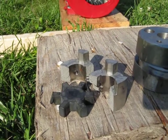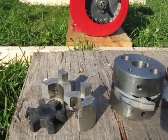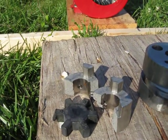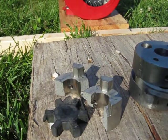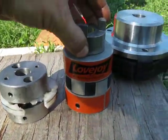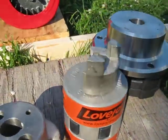It was a Lovejoy coupling, but I didn't advertise that at the time — I took the stickers off, just because you're not supposed to show name brands on YouTube. In the initial run, I only had about 5 seconds, maybe 20 seconds total before I broke the coupling on number one cylinder, as you can see here. Now, in all fairness to Lovejoy, look at the size difference — I had it way undersized.